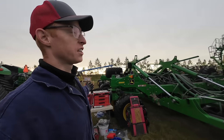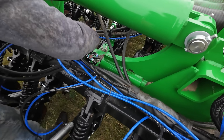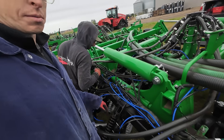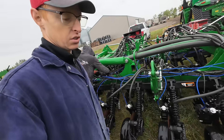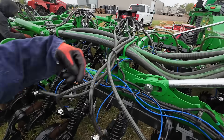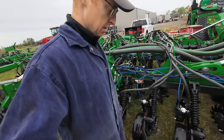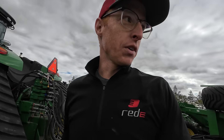Our sunshine and rainbow are gone and now it's raining. We're working on the dump valves. It would take too long for the normal air system to lift the row units at the end of the headlands, so the dump valves make them come up really fast so the row cleaners don't drag on the ground while turning around. Very important part of the system and we've got to get it fully routed in.